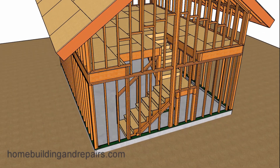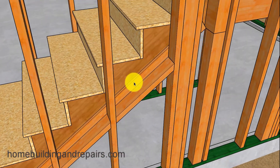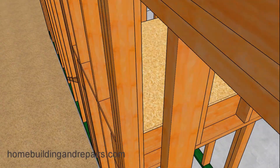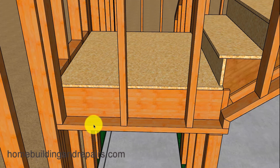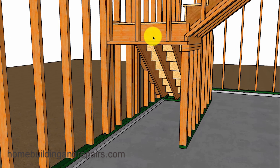The last thing I want to go over in the video will be the stairs. For our fire blocking, we can simply nail a flat piece here — we don't need a shaped block. Remember, your job is to block the air or the fire, and something like this will work just fine. Shaped blocks going up to flat blocks going around the landing — these blocks are to prevent air or fire from going around the landing. However, we won't need those blocks on the other side, but we will need a wall. I went ahead and framed a wall here so that we could enclose the stairwell, because you're probably going to need part of the stairwell to be concealed in order to create a fire exit from above.